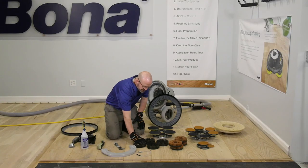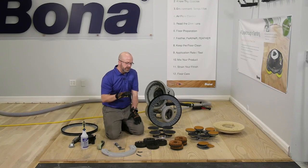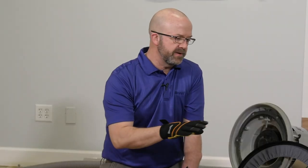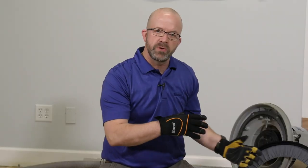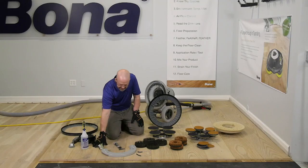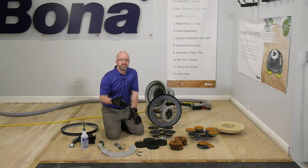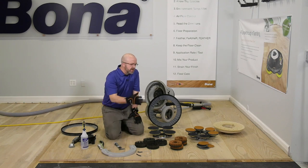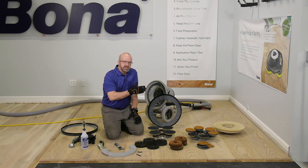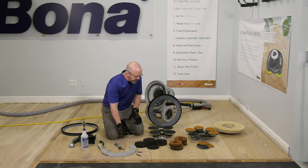So the wire brush is going to be standard. Your speed, making even runs, overlapping the way you're supposed to, right? It's just like buffing a fine floor in that we want to make sure we're doing everything evenly, because we don't want to take a ton of soft grain out here and hardly any over here. Depending on floor-to-ceiling windows and everything else, that may show up. So we still want to make sure we're doing a nice, even, smooth job while we take that grain out in an even manner.